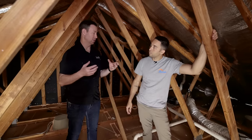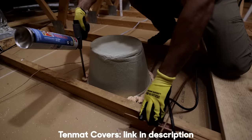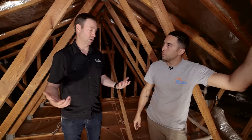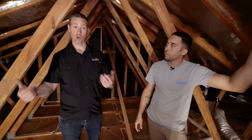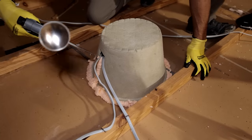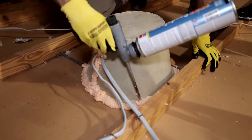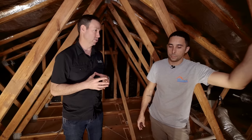Just to clarify, we're using 'rock wool' as a generic term — they're mineral wool based covers. We're getting them at Energy Efficient Solutions; they have locations in Austin and Dallas, and you can also find them online. These work for any can light, whether IC or non-IC rated, old or new. I don't trust the air-sealed insulated new construction cans to be as airtight as claimed, so even in a 5-to-10-year-old house I'd still seal them with these covers.